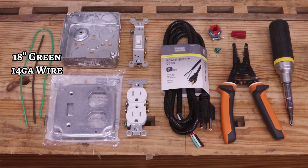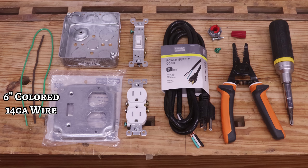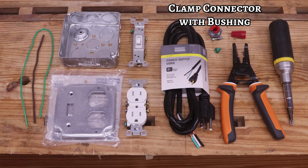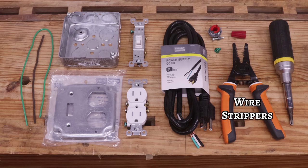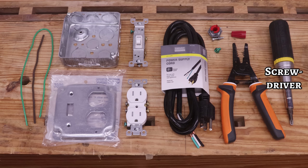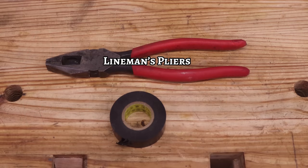18 inches of green 14-gauge wire, 6 inches of colored 14-gauge wire, doesn't matter what color, just not white, a clamp connector and red plastic bushing, a grounding screw for grounding the metal junction box, and a wire nut for connecting all the ground wires. For tools, you'll only need wire strippers, a screwdriver with number 2 Phillips and flathead tips, lineman's pliers,